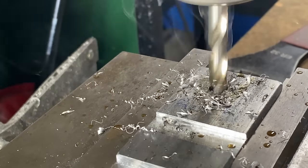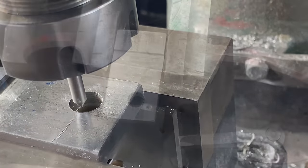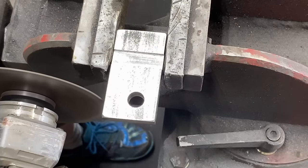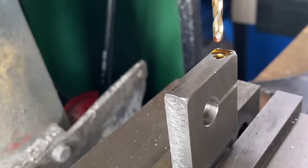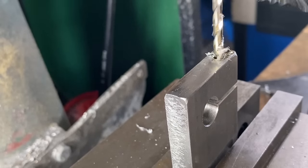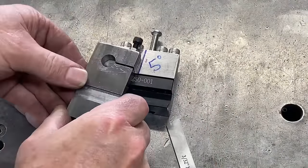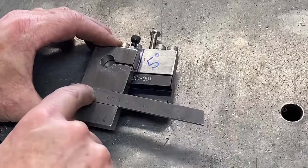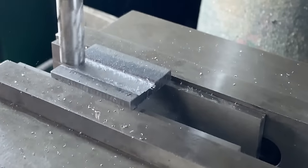This is a 12mm hole where this mechanism will spring. While I have it in the mill I'm going to scribe the line where I need to cut the slot. I could go and cut this in the bandsaw and make a nice straight cut, but what's the fun in that? This cut came out nice and straight and a lot faster than the bandsaw. This hole is for the spring limiter - it's drilled out and tapped for M5. The limiter is screwed in and has a locking nut on it. This piece is going to be welded on the side at five degrees, and the blade fits in the slot nicely.